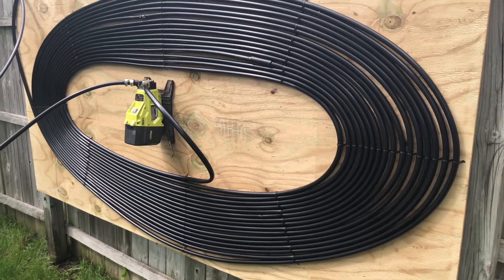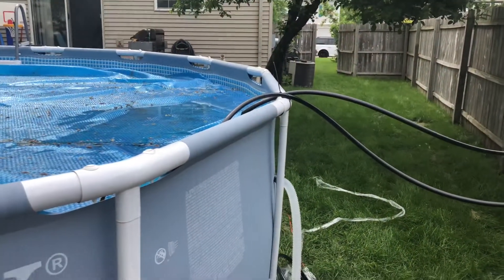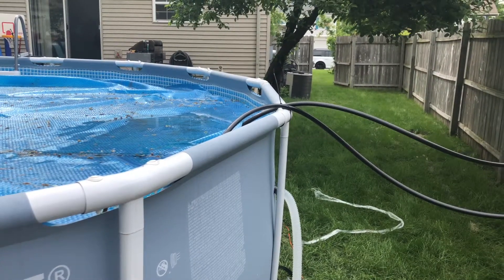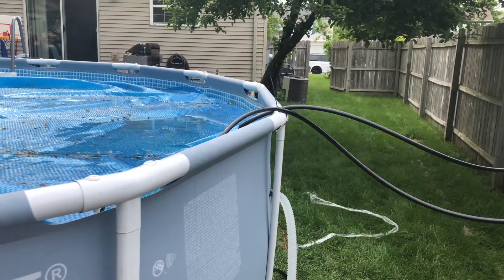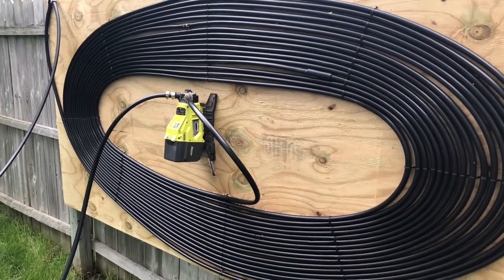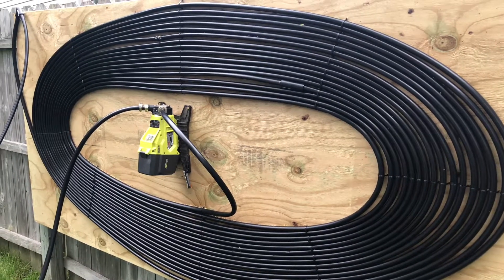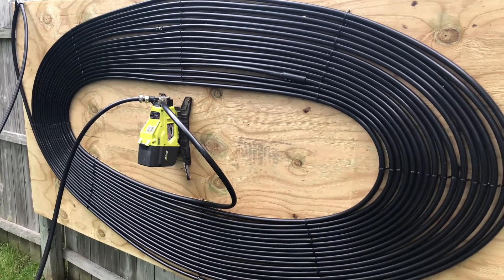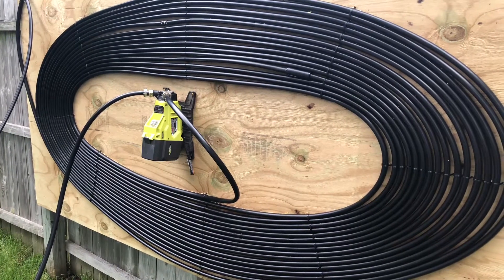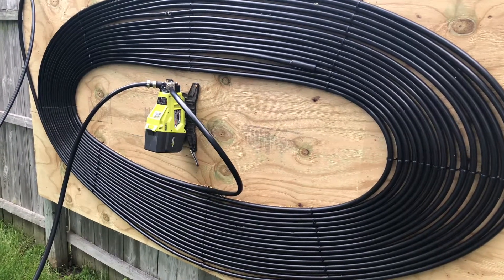This is what the pump looks like running when it's stalled. Let's get it in here, jump it into the tube. There's a whole degree difference right now, but there's no sunlight yet. So it's all said and done — it was just sunny a little bit ago. With my laser thermometer on the outside of the tubing, there was a 10 degree difference. The external temperature on the inlet side was about 70 degrees, and the external temperature on the outlet side was about 80.